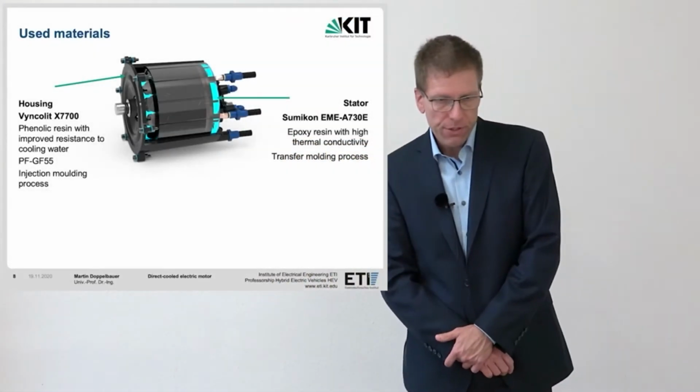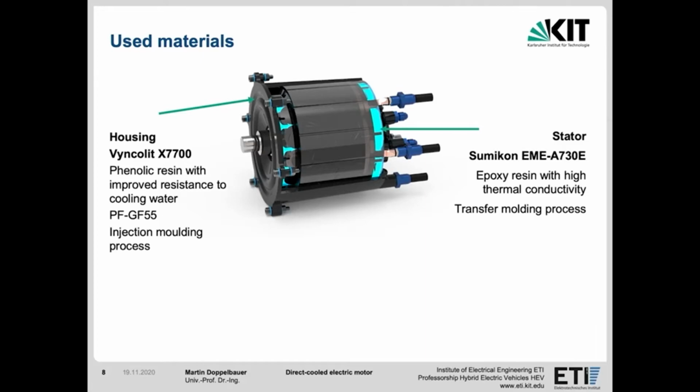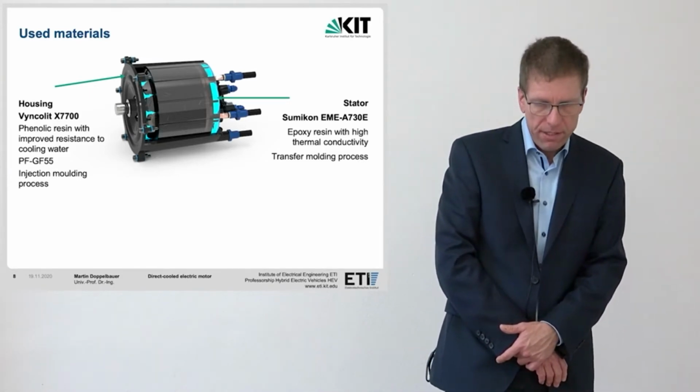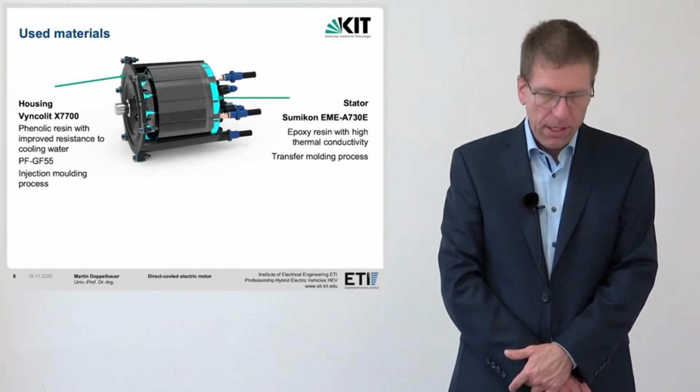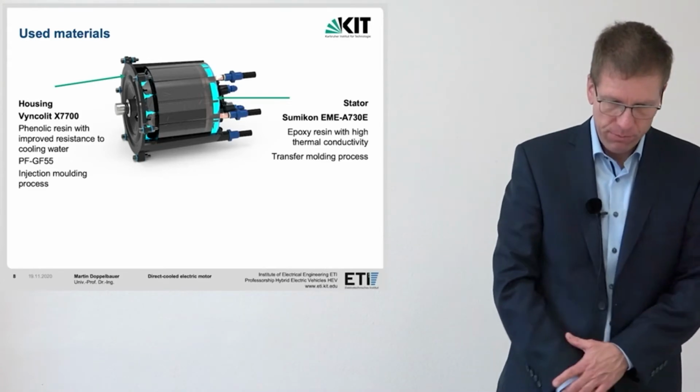In this video, we saw that two thermoset materials were used. For the stator, as I said before, a highly filled epoxy resin, which has the main task of heat transport between the coolant and the active materials, so it should have the highest thermal conductivity. This is processed in the transfer molding process. For the housing, a filled phenolic resin with improved resistance against cooling water, that is, water and glycol. The housing is processed classically by injection molding.